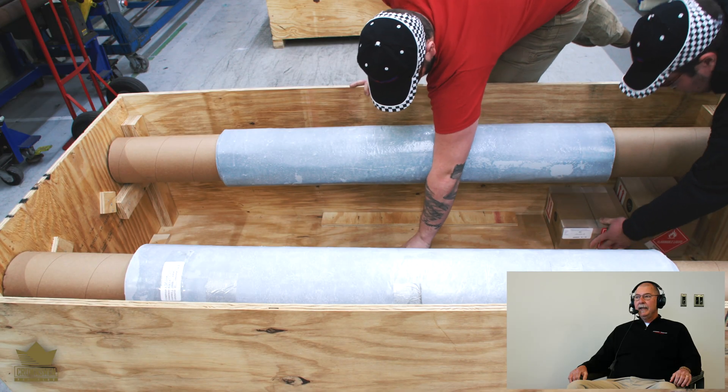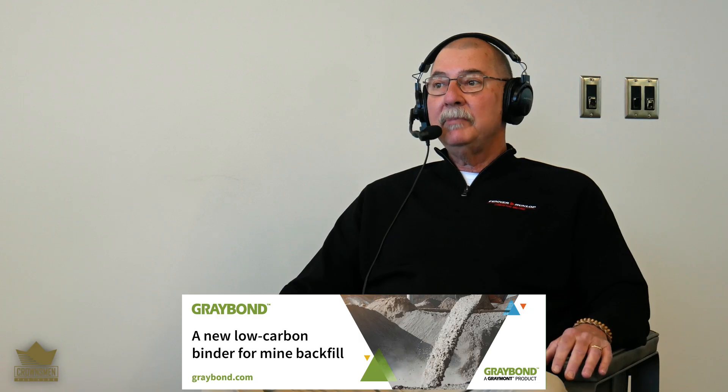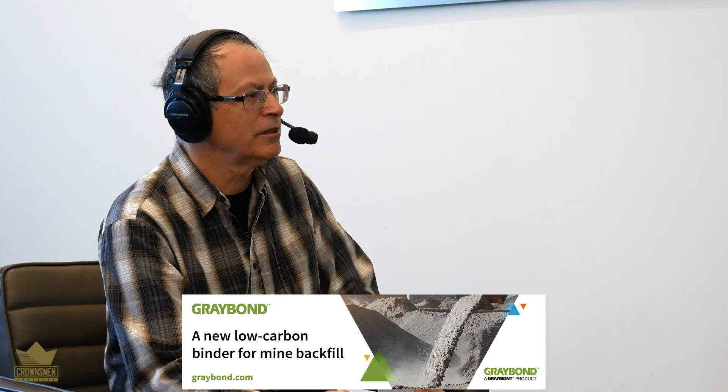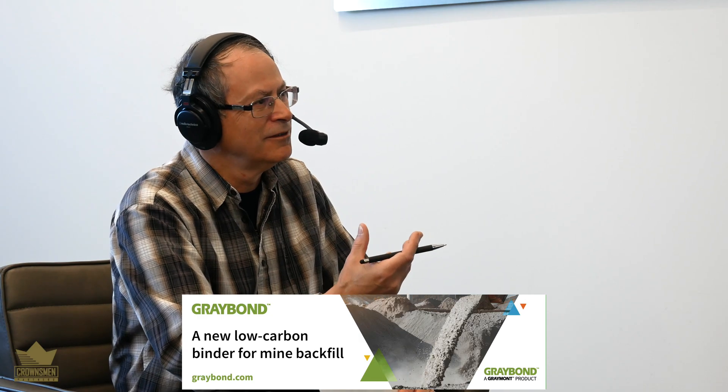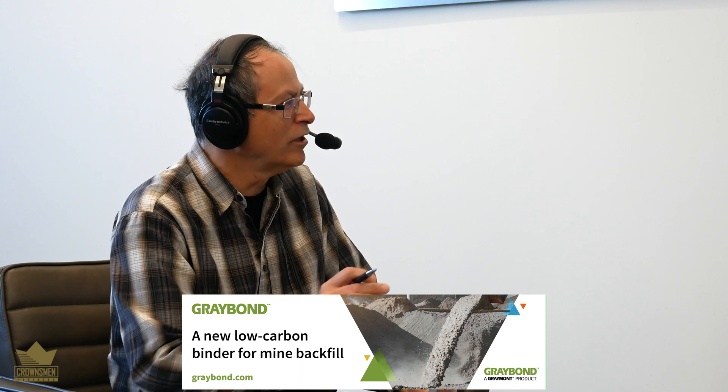All the material inside the splice kit is labeled, and it's important that it has an expiration date and matches the compound that the conveyor belt is made of. Since you're manufacturing the belt, who would know better what the best material is? The splice kit you provide would be custom-made and the right one for that belt.